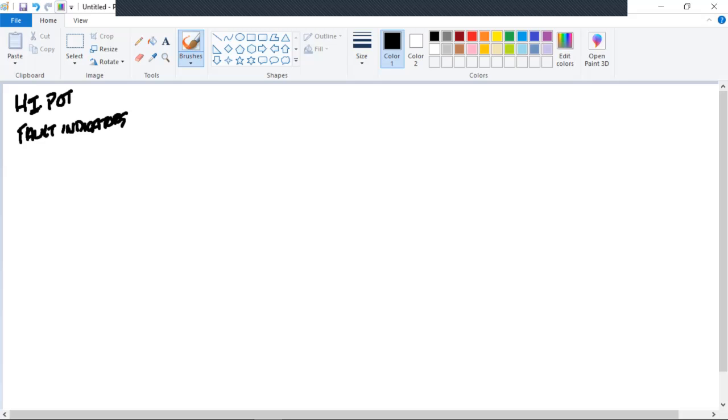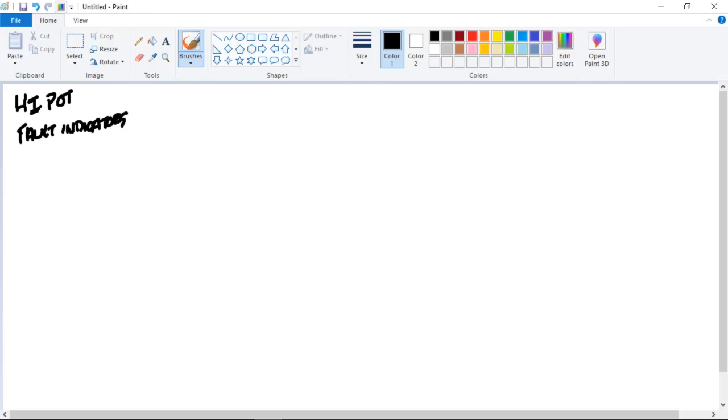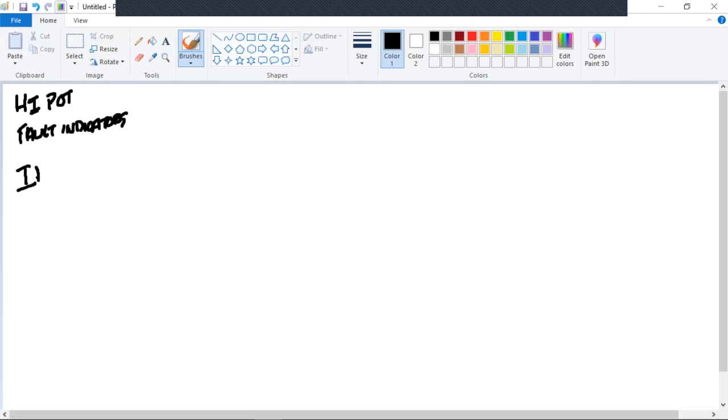Now, I want you guys to put down your notes, and of course, it'll be on your video here. There's three steps that you need to follow when you're in the process of restoration of underground primary. The three steps are identify, isolate, and then restore. If you follow these three steps in order, it'll make your whole life a lot easier. It's very important to keep that in your mind. First, I need to identify the bad span. I need to isolate the bad span, and then I need to restore.